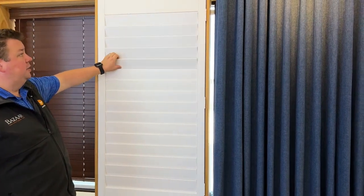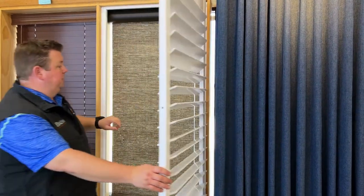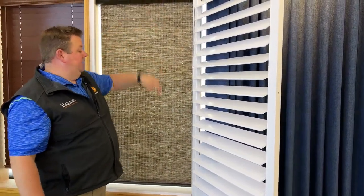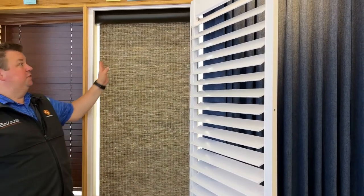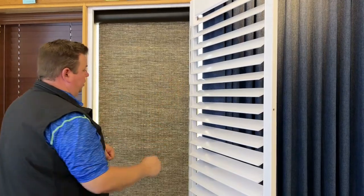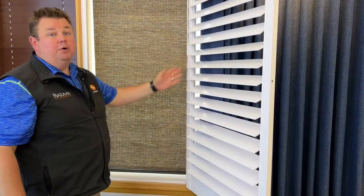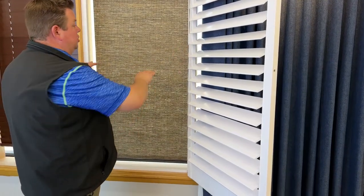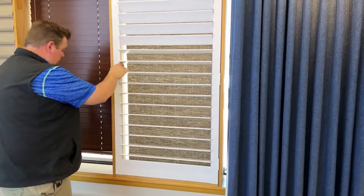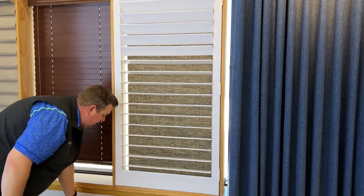This is a hidden tilt, or hang-strip-behind shutter panel. When I open this up, you'll see there are two hang strips and a light stop on each side. This gives us the frame needed to mount it on the inside. If you have tilted windows, you can still tilt that window in. If it's too big for the tilted windows, we do a direct mount, but we're able to get the shutter inside your wood window frame.